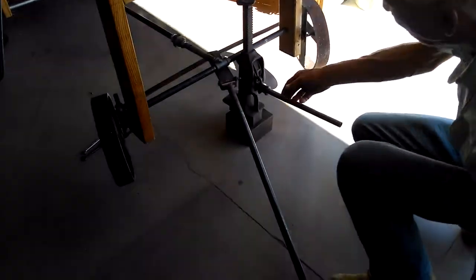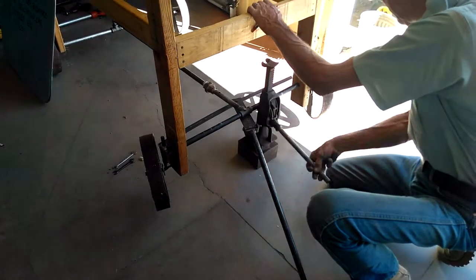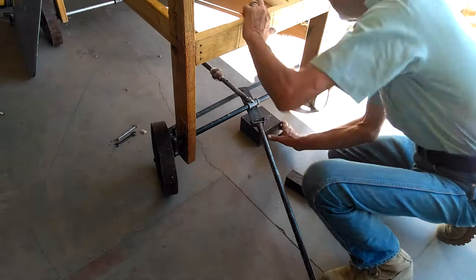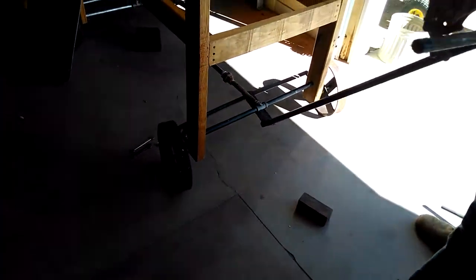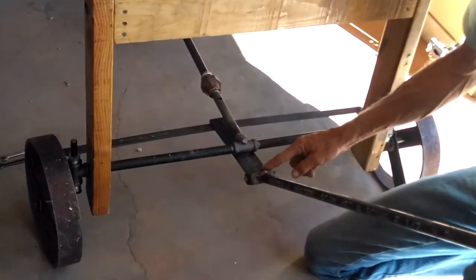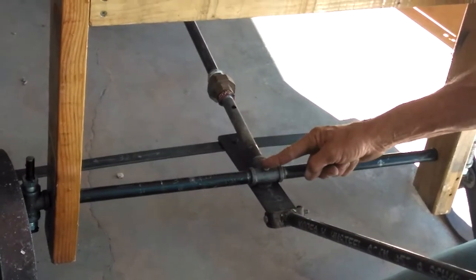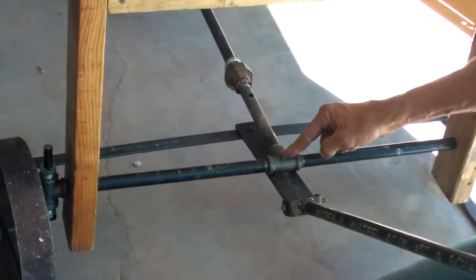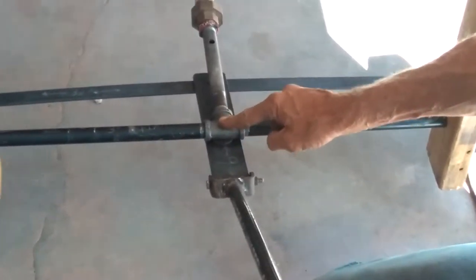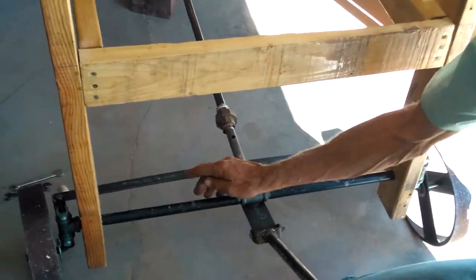Here's how we swivel — pretty nice and smooth. Let's get this jack off. See how that is? From the front of your 9-inch piece of 2-inch by 3/16ths flat, you'll want to come back 3 inches for your pivot on your tongue. Your tie rod, which is also 3/16ths by 1-inch flat, you'll want that to be 32 inches.